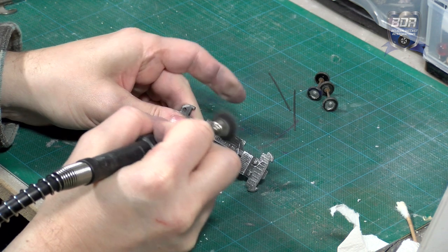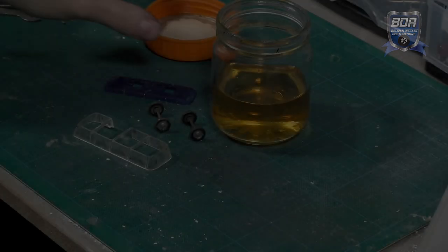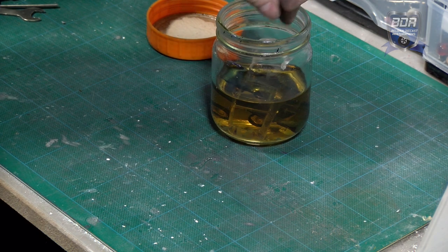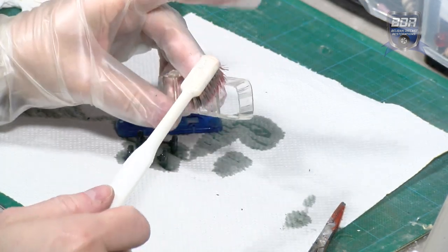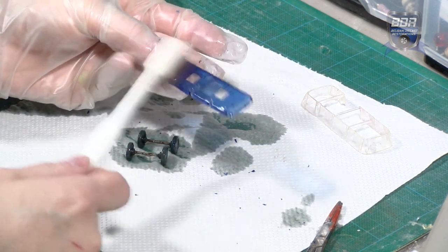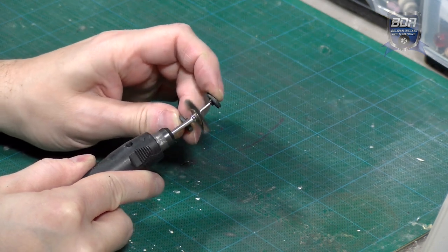The vinegar has removed the rust from the axle, suspension and bottom plate. The bottom plate and the suspension rods are wire brushed to bring back the original shine. The wheels have been painted by a previous owner, so they take a bath in Dettol disinfectant together with the windows to remove the paint. The wheels and the windows come out of the Dettol and I can simply brush the paint away. The axles then also receive a polish with the wire brush to bring back their shine.